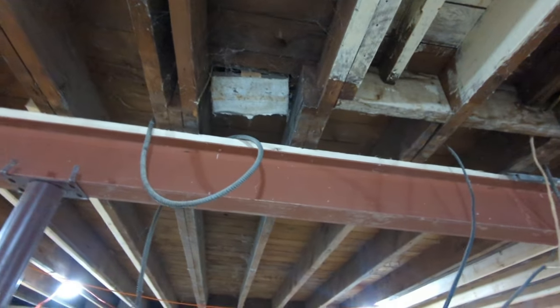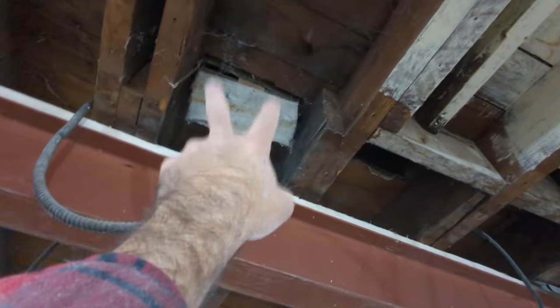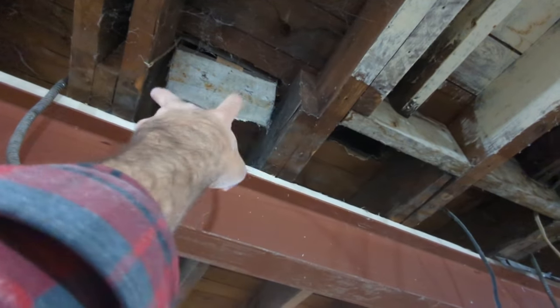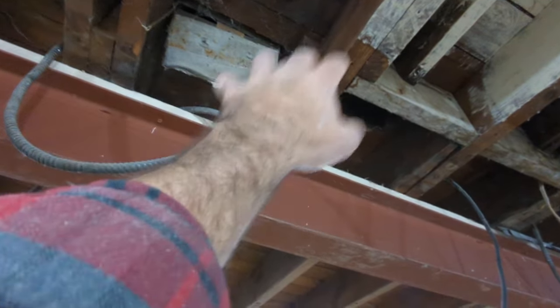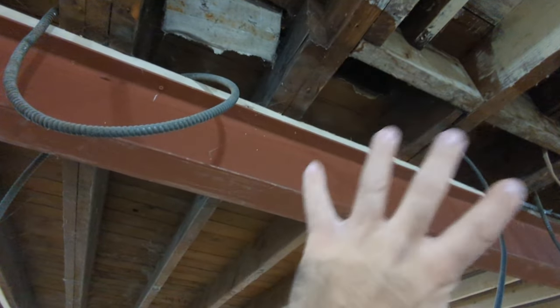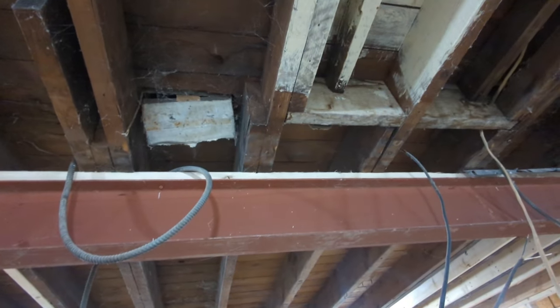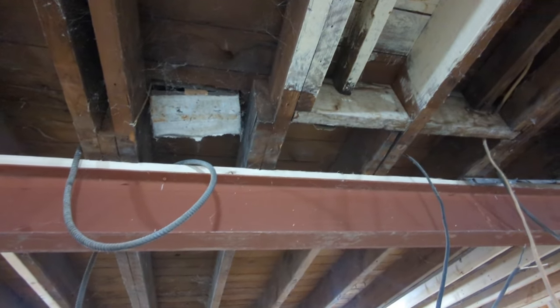But you've got a lot of time there, and you go upstairs on the second floor, and you could send PEX up and come out through the old register in rigid pipe so it looks nice, and do it to the bottom of that opening and take the register cover off. So someday if somebody wanted to make a quick drywall repair, they could just do that and keep on rolling. They'd have to disconnect the heater.